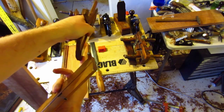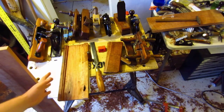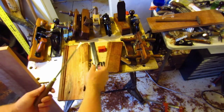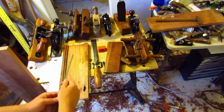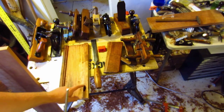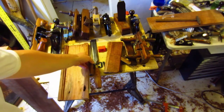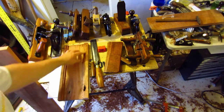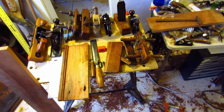You just rotate this around and you can create a 90-degree arc. Once you've done that, you may have some areas that look a little rough. You take your paring chisel — this is my narrowest and thinnest — and there's another one slightly larger. I use those to clean up any areas of the molding where I may have dragged a corner a little bit or was a little too high on an edge, or something still has a facet showing. Then the way to get this looking shiny is to take shavings from removing all this wood and just rub them into the wood — it burnishes it, makes it shiny and hard, and smooths out any rough spots from imperfections while planing.